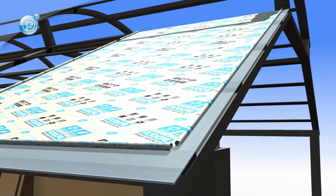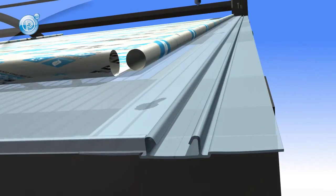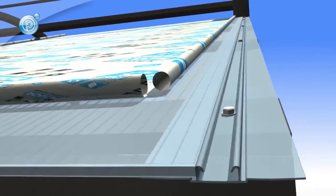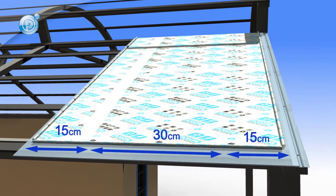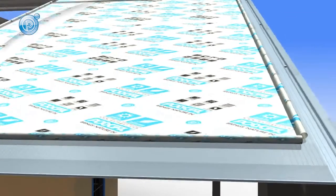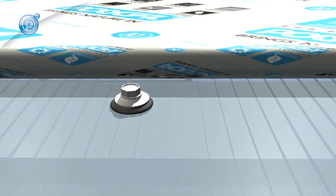The base profile should be fastened to the structure's rafter or purlin supports. Fastener location should be as close to the middle of the base profile as possible when securing it to the structure. Before installing the screws through the sheet into the rafter or purlin, make sure to pre-drill holes slightly larger than your fastening screws to allow for thermal expansion and also allow for the gasket or spacer between the base profile and the structure if needed.